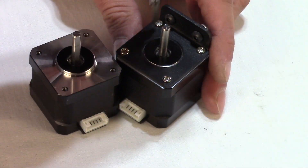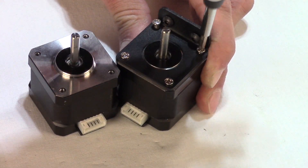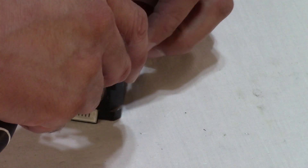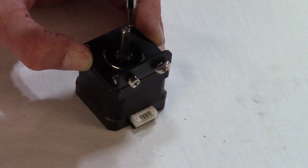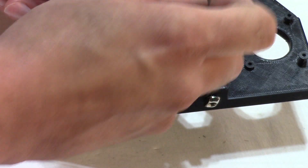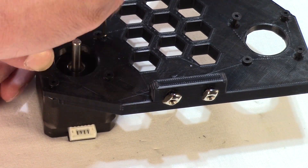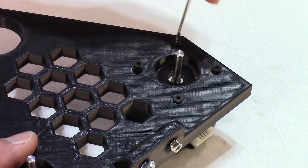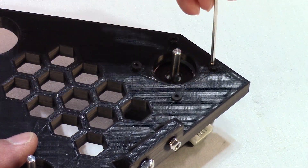Step 8: Motors. If using a single motor setup, dismount the Z motor's mounting bracket and install it onto the extruder gear motor, making sure the motor's power connector is pointed down matching the plate's mount, using a Phillips screwdriver. If using the dual motor setup, match the two twin matching motors together and install them into Recreator Part 5B Spool Holder Pro dual motor. Mount with the four M3 by 12 hex screws per motor using size 2 hex tool.